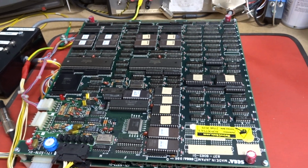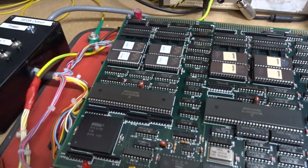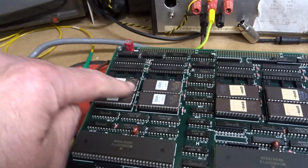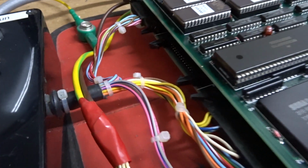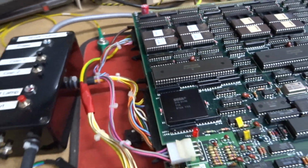I've also done service parts. Some of the edge capacitors were bulging and a few of them were not, so they've all been replaced on both boards. You've got the enhanced ROM set fitted there, 4, 1 and 2. I've also fitted a new set of dip switches, and I have repaired that broken connector there, because that's a standard 26-pin IDC type.